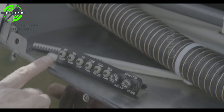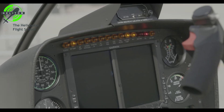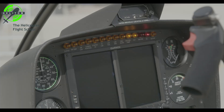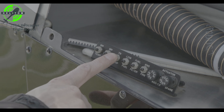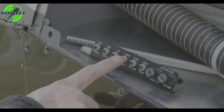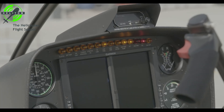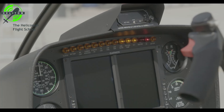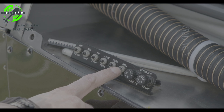Test all warning light switches. Main rotor temperature switch — check light on. Main rotor chip — check on. Tail rotor chip — check on. Low fuel — check on (can take a little bit longer). Fuel filter — check on. Engine fire — check on.